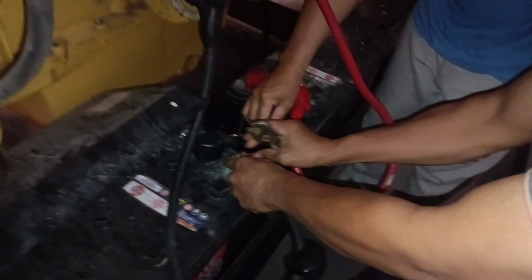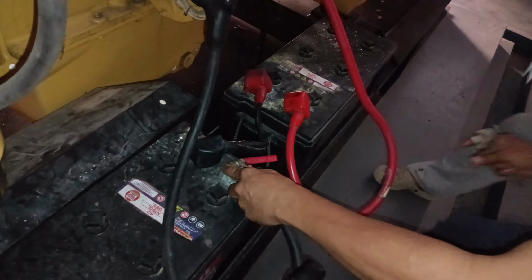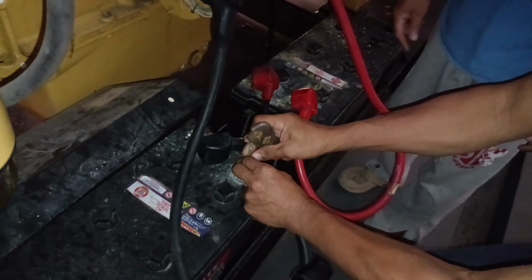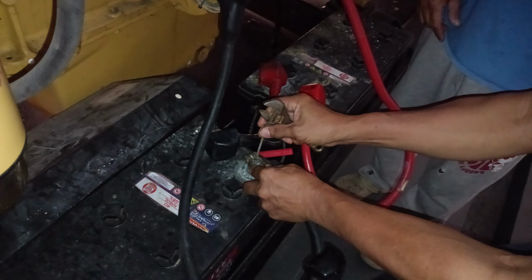Terminal repairs: secure any loose wires using electrical tape. Gently clean corroded terminals using a dry brush or cloth. Avoid unnecessary physical contact. If the terminal is severely damaged, document the issue and arrange for repairs later.